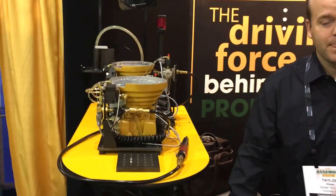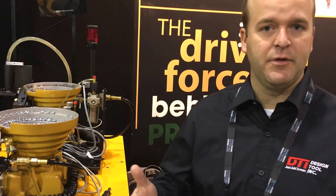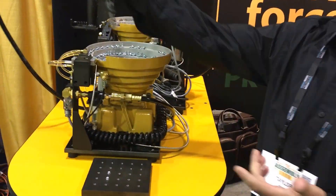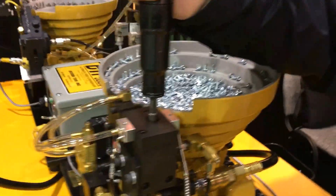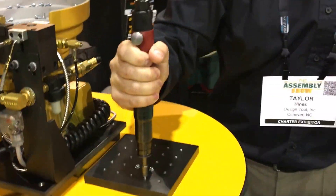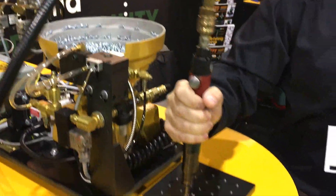Why should I use a screw presenter? Outside of a 5000, if screws can't be blow-fed — meaning that the shank is less than the diameter of the head — then you have to present it. It's going to take it out of the operator's hands; it's just not going to be blow-fed. So it's going to isolate a screw one at a time for pickup with a magnetic bit or a vacuum pickup system. It still greatly increases your productivity, but it's not being blow-fed.